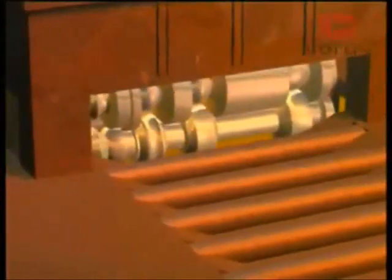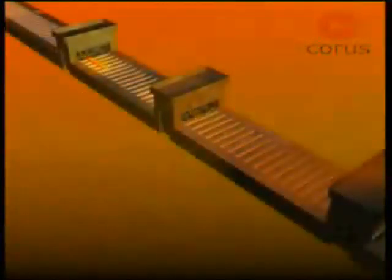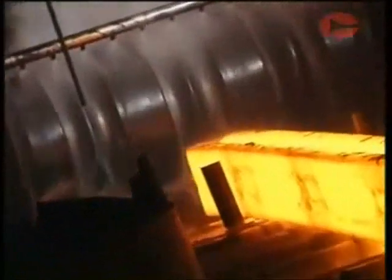The layout of a rolling mill can vary from a simple single stand mill to several stands positioned either side by side or in a line. The mill rolls themselves can either be plain, for flat products such as strip used for cladding, or profiled for sections, beams and columns for use in construction.